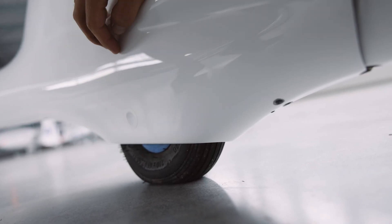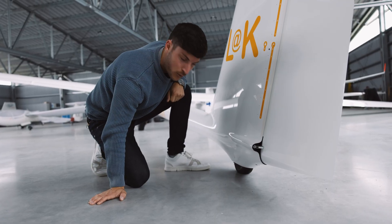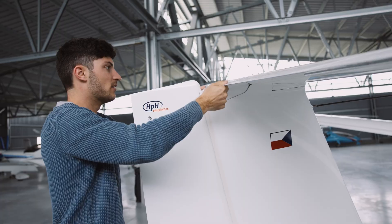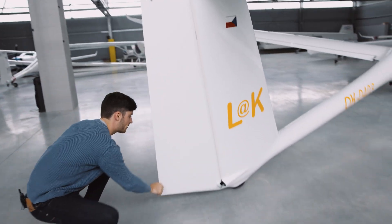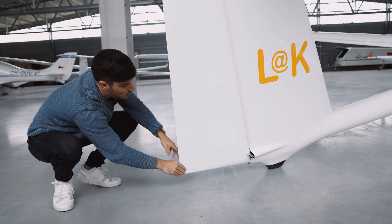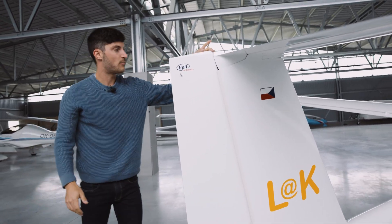When we are here at the bottom of the tail, we need to check the tire pressure — check visually if it is flat or not, but you should confirm you have 2.5 bars. Elevator up, down, middle — and by yourself, move, no play, great. Rudder left, rudder right, rudder middle. I recommend to take the rudder here at the linkages, because the force is better there than up top — otherwise you are twisting the rudder and we don't want to damage the glider during a check.